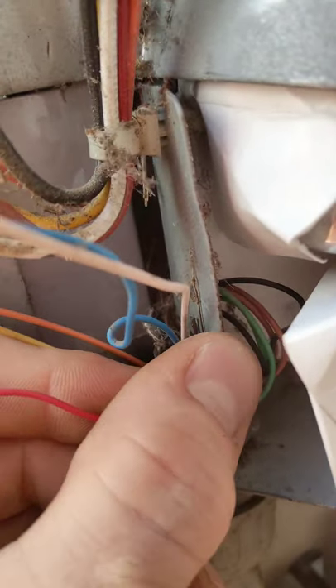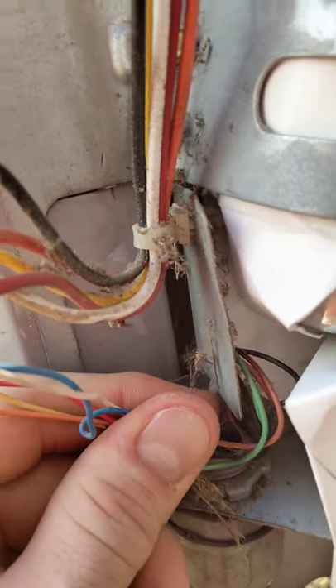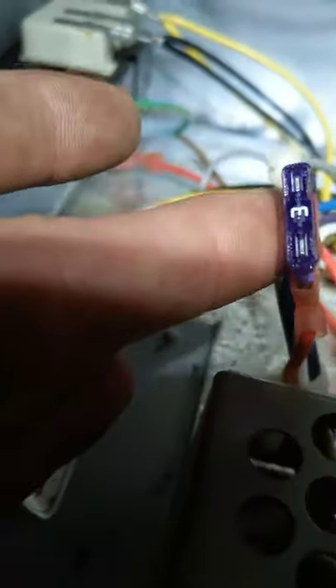What I'm going to do just for the heck of it is get some electrical tape and wrap all of these wires coming out of here — all the way up about an inch or so — to prevent that from happening again or happening on a different wire. Since I have the 24-volt wire at the condenser repaired with no more short, I want to put in my 3-amp control fuse and I'm ready to cut power back on, put the door on, and see what we've got.